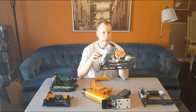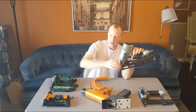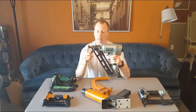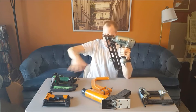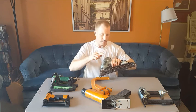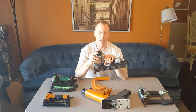This angled finish nailer is typically used for hanging doors. Doors take a lot of abuse being swung back and forth, but we install with finish nails. This Hitachi has a rubberized nose guard, a way to clear jams out of the nose, and a depth-of-drive adjustment wheel to control how deep the nail is driven. It's got a magazine with a spring-loaded follower, and sequential and single-fire capability with a lever that switches between those two modes.